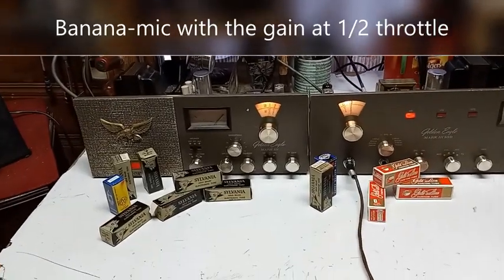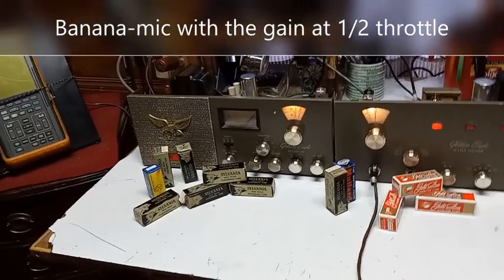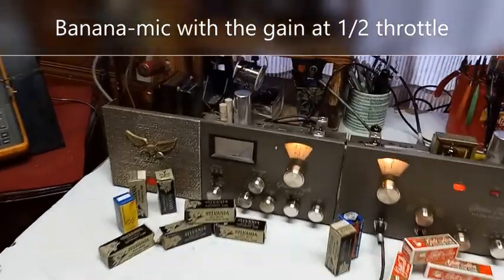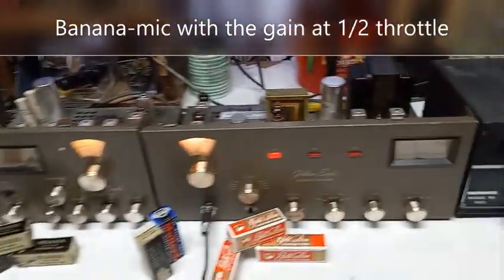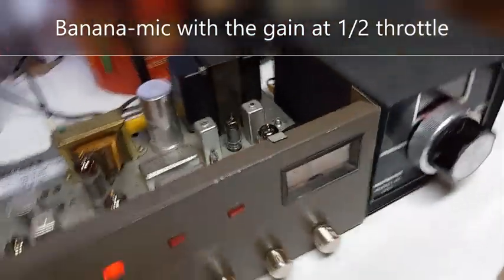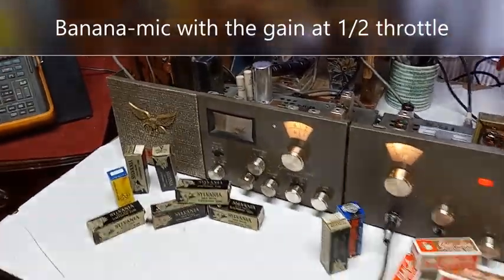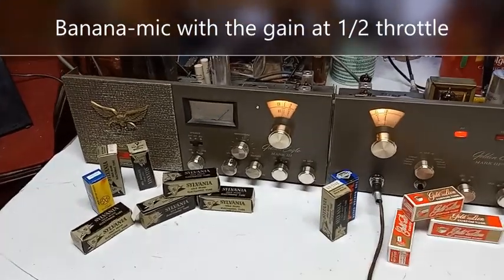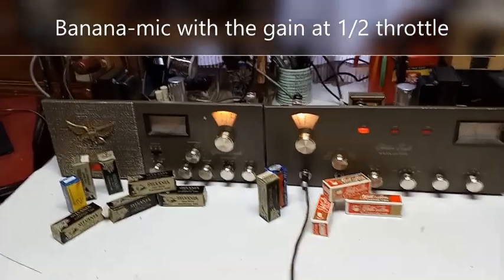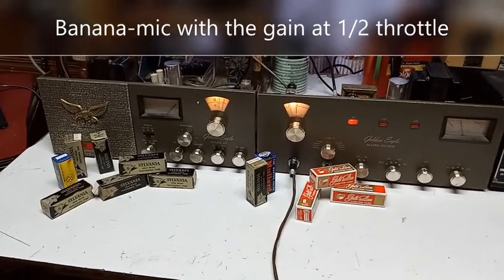Like I say, if there was any hum or anything, it's got all new caps. I put in audio caps, fancy audio caps. And like I say, he's running a Genelex Gold Lion audio chain, and he's got one in the oscillator position here, which just drives the snot out of these radios. And this is a late model Mark III, like I said. It's got the ALC and some of the stuff the FCC was bugging him to tone these things down a little. I normally don't see this kind of performance out of the late models, but you get a good hot set of tubes in there, and I guess anything's possible.